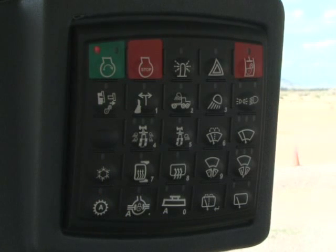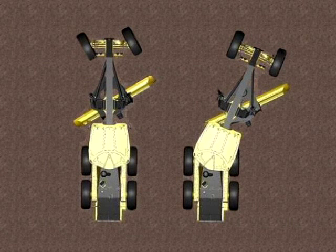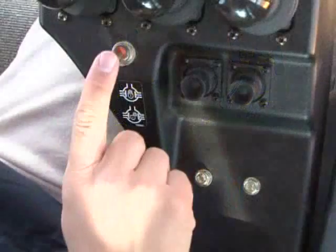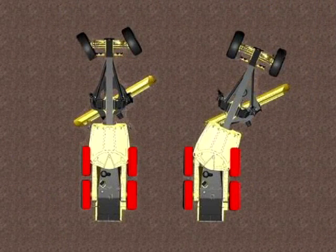The next switch is for the automatic differential lock. With the LED illuminated, the rear axle is locked so that the right and left wheels turn together when the grader is traveling straight in 4th gear or below. However, if the front wheels are turned so that they are at a different angle than the tandems, the differential lock will automatically disengage. Once the front wheels are aligned back to the same angle as the rears, the auto diff lock will re-engage. Note that if the manual differential lock switch is turned on, the diff lock will remain on and will not automatically disengage when the wheels are steered.